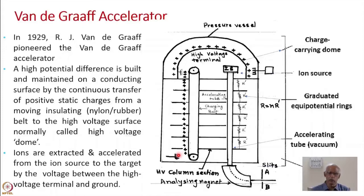Because of the sharp points there will be a high field, and as a consequence the gas in that region will be ionized, forming positive and negative ions. Positive ions will be attracted toward the grounded pulley, but since a belt is running at high speed between the two, those positive ions will be collected by the belt and transferred to the high voltage terminal. Inside the terminal a similar system takes the charge to the terminal surface. Since by electromagnetics the interior is an equipotential volume, the charge cannot stay inside and goes to the outside surface.